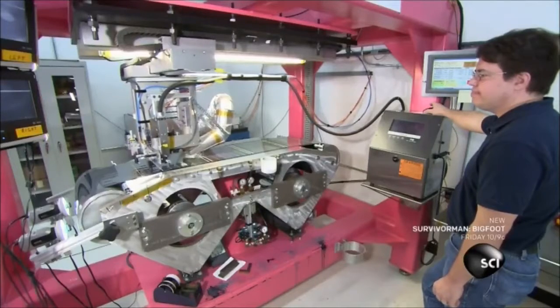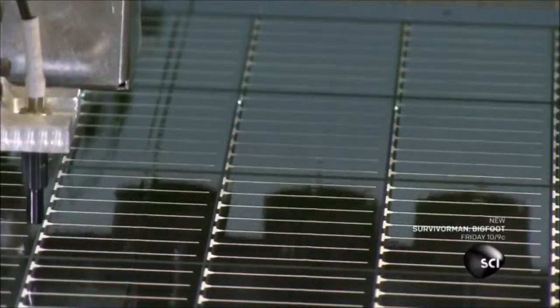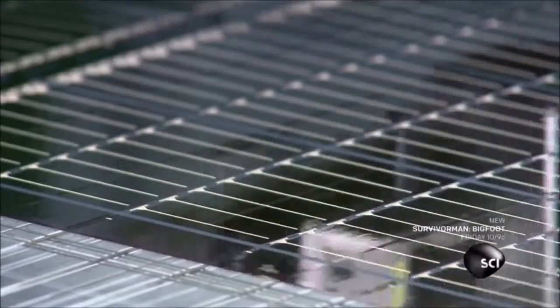A laser now connects the solar cells, linking the bottom aluminum layer of one cell to the top silicon layer of the next. The laser ties them together, similar to how a soldering tool would. This establishes electrical connections and increases the voltage significantly. A different camera magnifies the connections to check the alignment.